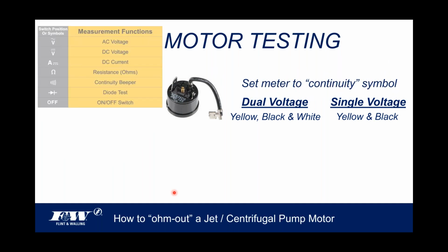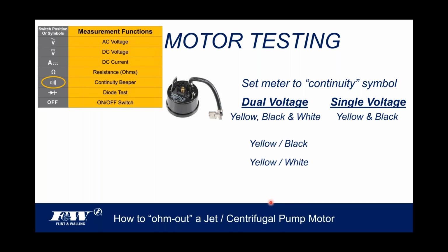So we're going to set the meter to the continuity symbol right there. You'll have these different symbols on your multimeter, whether it's analog or digital, and you see this symbol here, continuity. That's what we're checking, the continuity of this thermal overload. The way that we do that is we take our multimeter probes and touch the yellow to the black wire, the yellow to the white wire, and then the black to the white wire. So we've essentially checked every lead on a lead to lead basis.